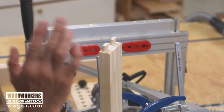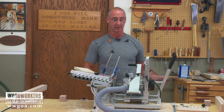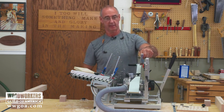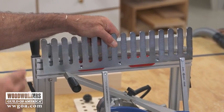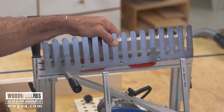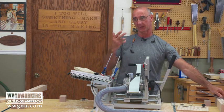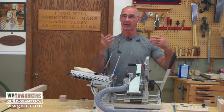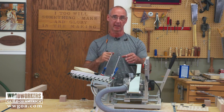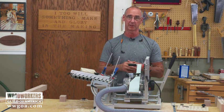Pretty neat. So, mortise and tenon. Now, again, use a little imagination. You can see how, if this template was on our fence and we followed that with the stylus, we would get box joints. There are also other shapes available. So conceptually, we're going to use the same idea over and over again. The stylus is going to follow a pattern, the router bit's going to make the cut, and we're going to get the fit that we want in the resulting joint.